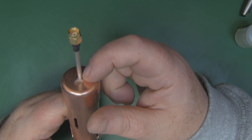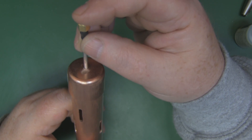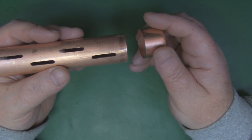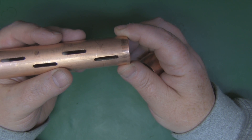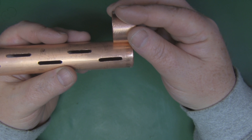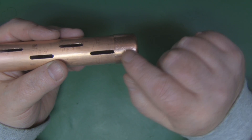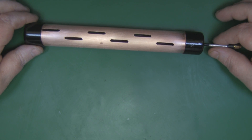I'm going to flow a little solder around the hole in the end cap to solder the outer braid directly to the cap for a strong connection. Then I'll attach the end cap to the top of the antenna. Since the tube length was decided after purchasing the caps, I'm positioning it only to the top of the slots so it doesn't cover them, and using a couple of dabs of super glue to hold it in place. Here is the finished waveguide.